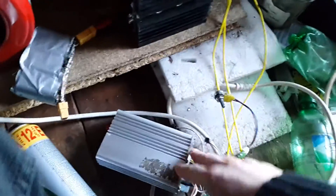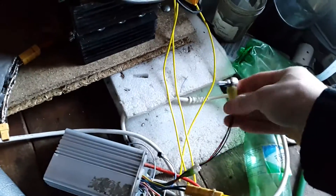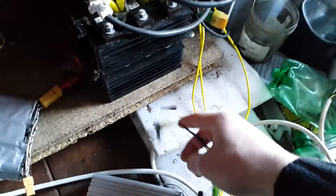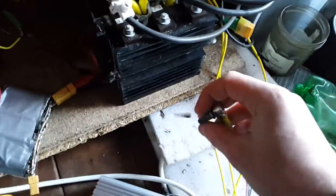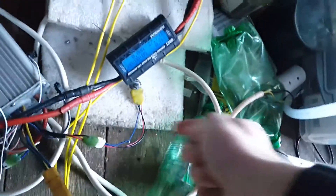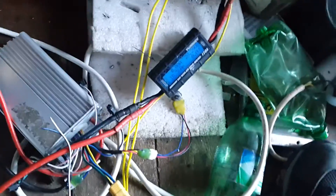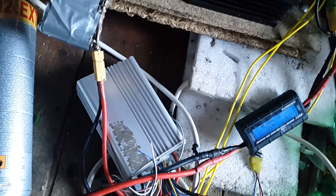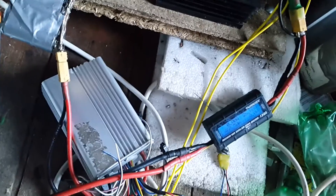The generator has started using an electric bike controller, and this potentiometer just acts as the throttle. I'm going to add on a push button switch so I could just press a button to start it. I tried putting the button in between the signal line from the potentiometer and the controller, but it just wouldn't work. I think it's because the controller expects some sort of ramp up on the signal — it's a safety feature so that if you connect a throttle and it's stuck wide open, your electric bike project doesn't take off and kill someone.